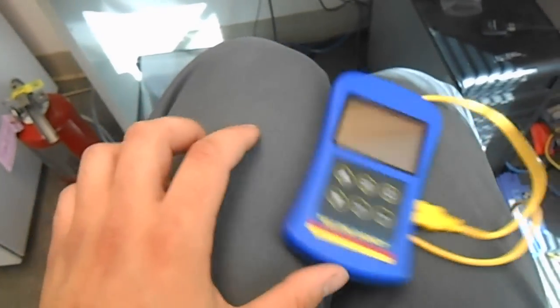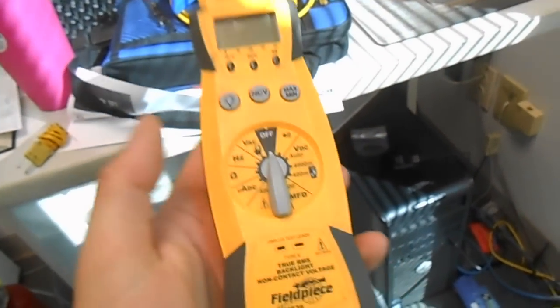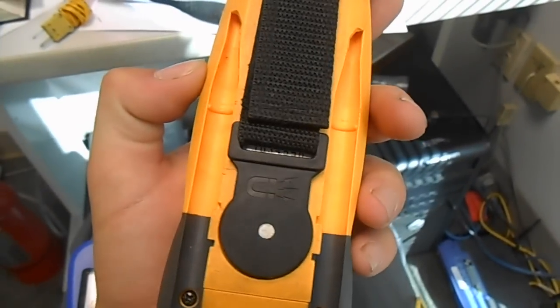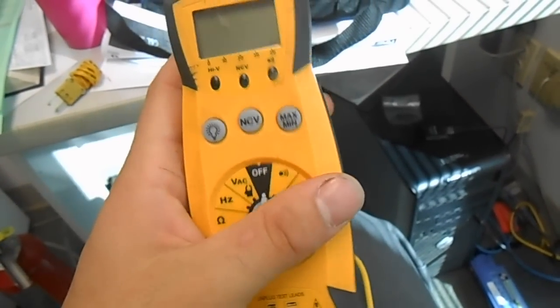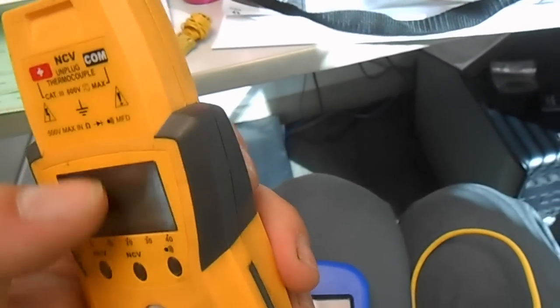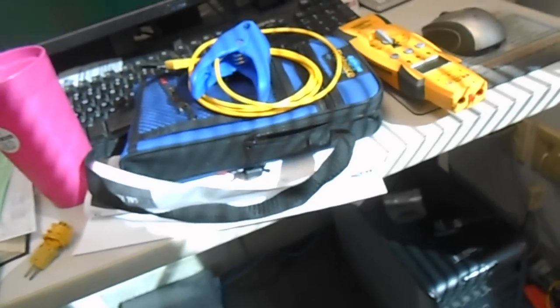Should have a new tool video coming up here pretty soon — this just shipped a little earlier than everything else, so I wanted to do just a little calibrate-your-instruments video. And if you ever find that your Field Piece is off, you can take it apart — there's an adjustment — and you do it with the stabilized ice water. You just take the back part off, hold the battery in with a rubber band, put your beaded thermocouple in the stabilized ice water, and then you can make an adjustment to get it as close to 32 degrees as your heart desires. Field Piece is a little more accurate.